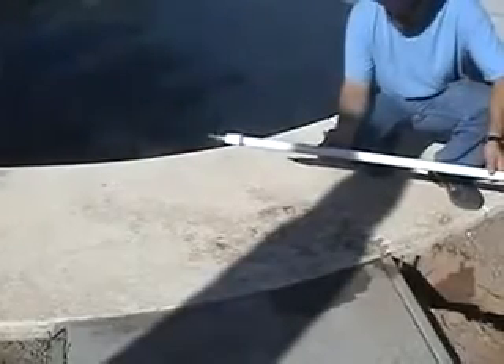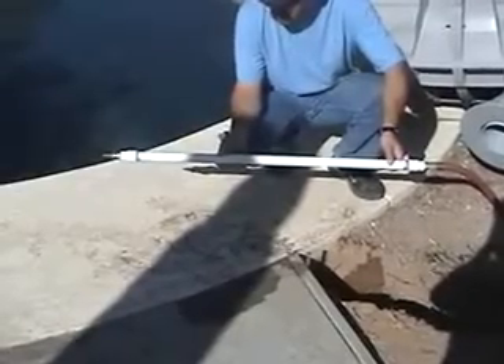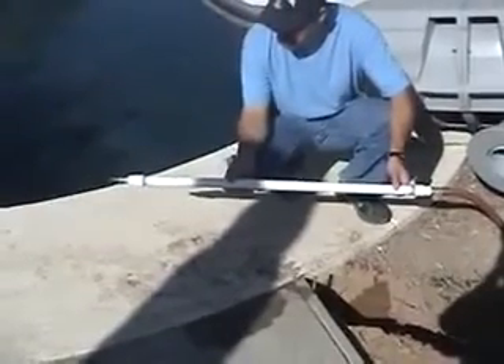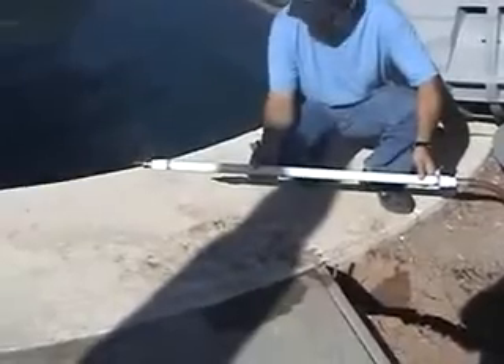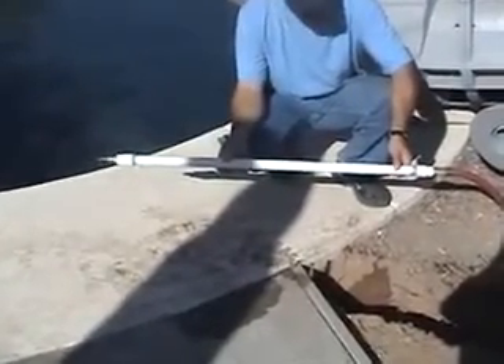In order to dig under the deck, we will want what we call a water wand. To construct the water wand, you should use a PVC pipe the same diameter as the pipe for the stub up — in this case, one inch.